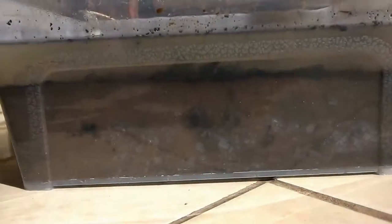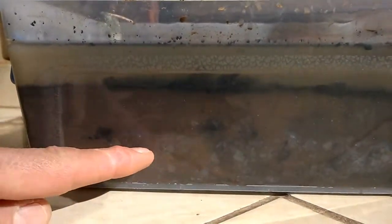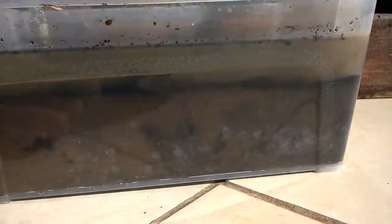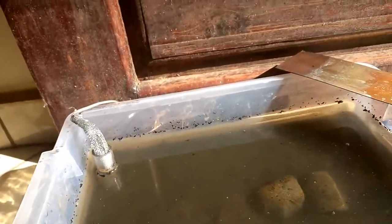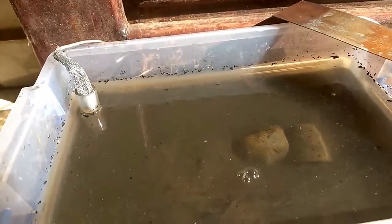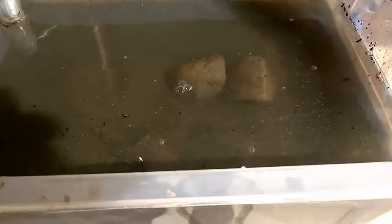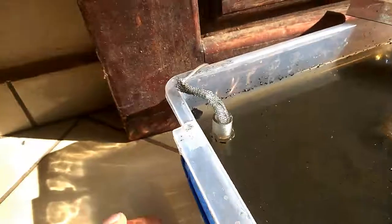I have just spotted something that might actually be causing the problem. There's a lot of air bubbles — or gas bubbles — that have formed in the mud, and when I move the box I had a little blop blop blop coming up. So perhaps gases are getting trapped in there and have isolated the electrode.